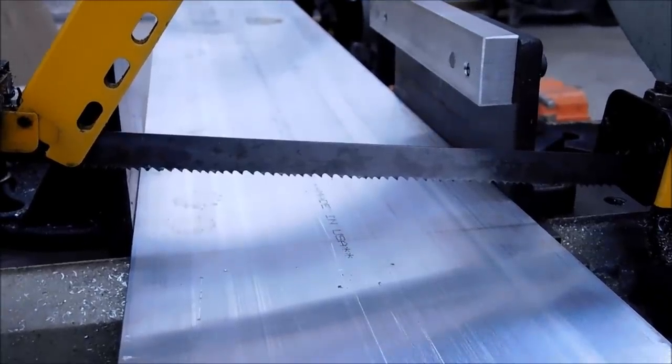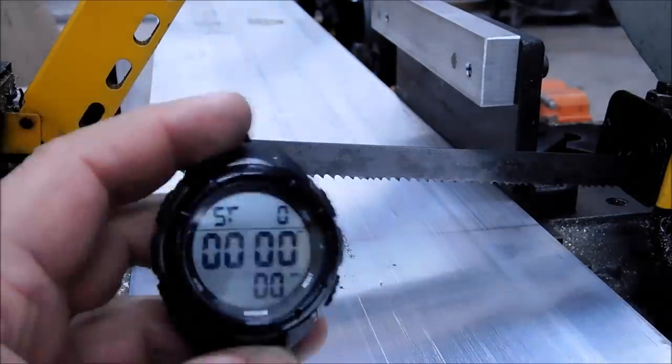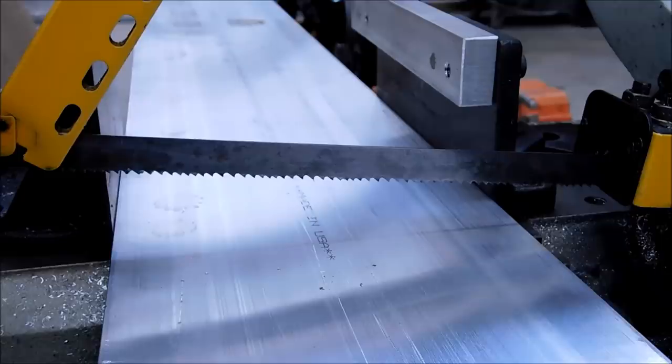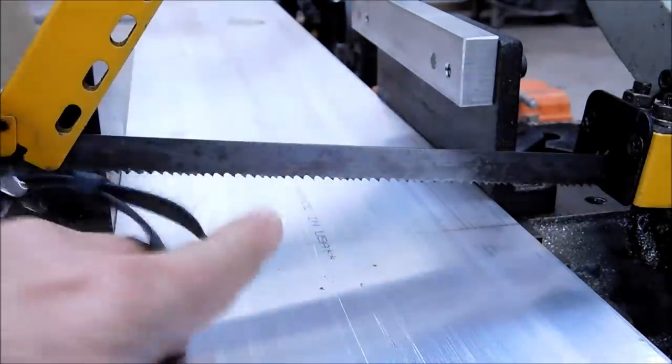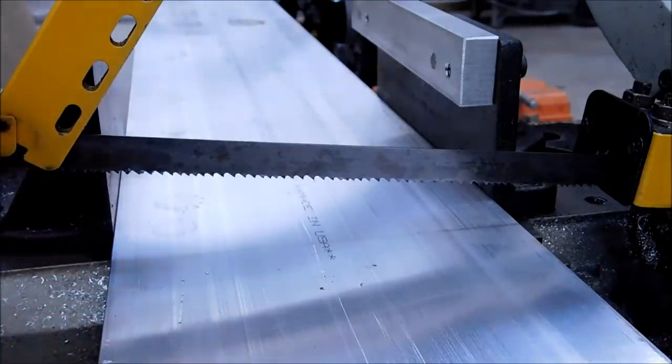Alright, let's put the power on. Reset the stopwatch — we are sitting at zero right now — and make the first cut. I suspect this is going to take just a little bit over three minutes once it makes contact. It'll start off real quick, get about halfway through, and from an end perspective this blade will track full eight inches wide for about one third of the thickness of this material. This is process number one: laying it flat on the saw like everybody does.